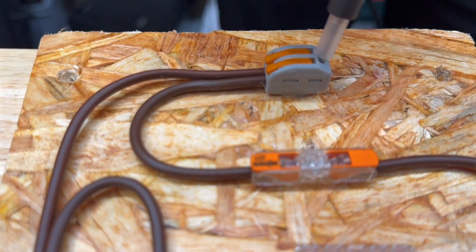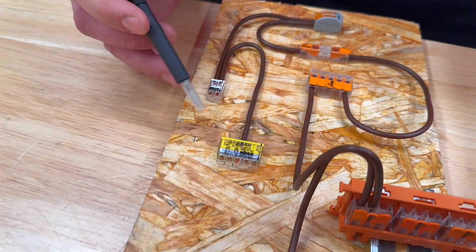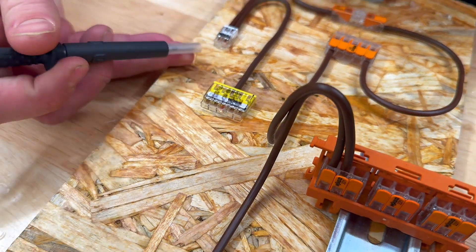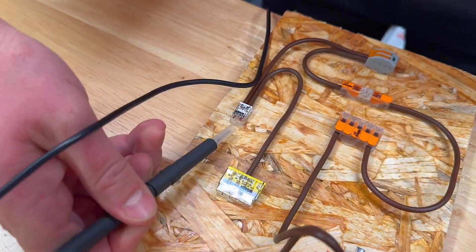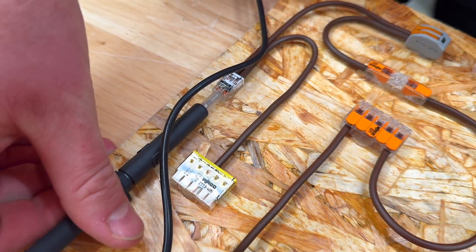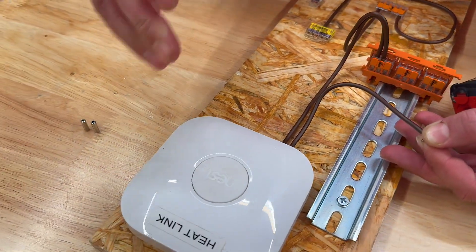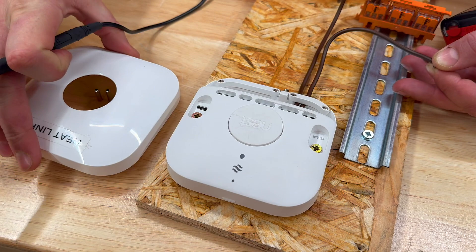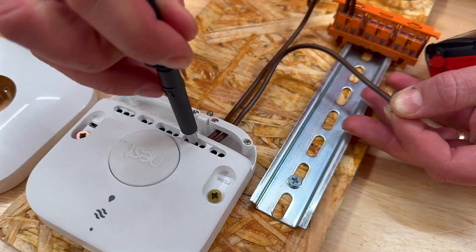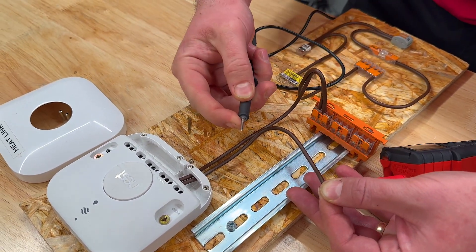The test position is here and there we go, we get sound. Then we move across onto the 2273 connector, where the test point is just on the ends here. I'll see if I can get these in there without breaking this jig — there we go, continuity on that one. Let's say we want to test our heat link here — just remove that lid and test on these connections. We're straight in there, so it then allows us to get into the smallest of spaces.